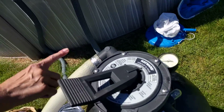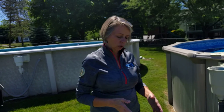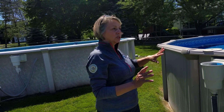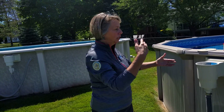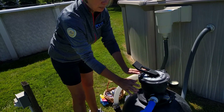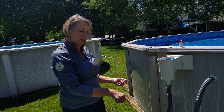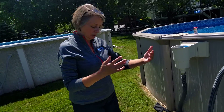One very little-used setting that I really love on the other far side is called Recirculate. Recirculate is a great thing to use — we talked about algae blooms and not putting live algae into your sand. There was one year I took the cover off the pool and I dropped it before I could get all that junk off the top and it all went into the pool. I had algae honestly that was like six feet long. So what I did was what I call shock the bejeebers out of it — lots of chlorine and algaecide in there — and then I put it on Recirculate for 24 hours. All I did was like a big spoon — I took all those chemicals and stirred it up. What it does is takes the chemicals, brings them down, comes up to your multi-port, and then just stops — it doesn't come into the sand filter and shoots everything right back into the pool. So all you're doing is recirculating all your chemicals, bypassing the sand. But again, 99% of the time you're going to be on filtration.